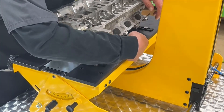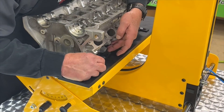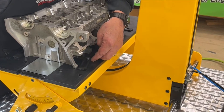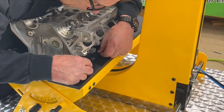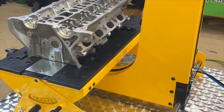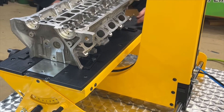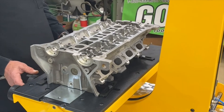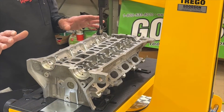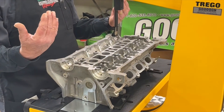You can see these clamps back here because of the strange configuration of that deck surface on this cylinder head. We'll want to make sure that the clamps are correct. Remember, the outside one controls the top dowels as they move in and out. I've just got to get enough to make sure I'm clamping that correctly on that side. Then over here the same way — I just need to make sure I can bring enough pressure to hold that in place. Then I want to come up to the front and snug that on the inside handles. They control the bottom, but I don't want to lock everything down at this point because you can see these valves are at an angle and I need to tilt this table towards me.